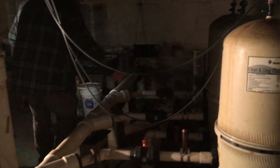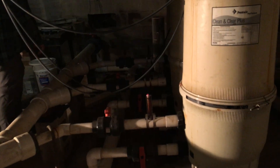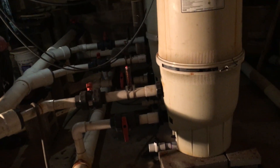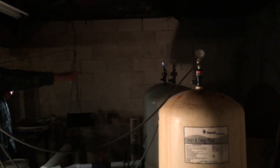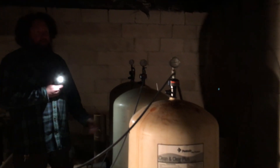When we're using the filters, the valves on the filter will all be open. There are two on each of the filters. The drain at the bottom should be closed. When you start using them, you need to drain the air — these things up here, when you open it, you turn it that way to release the air, and then water comes out. Do it so the water won't hit you from the back side.